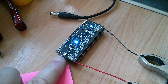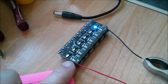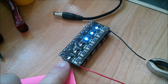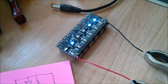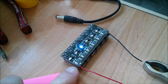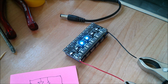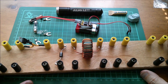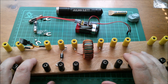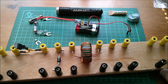I've added these blue LEDs — they're just in parallel with these resistors. Those resistors never see more than 2.7 volts. You can put 2.7 volts through a blue LED with no series resistor because it just isn't anywhere near the voltage required for a significant current to flow. And in any case, the current flowing through that LED is only flowing at the same time it's flowing through the resistor — so you want current to flow and discharge that capacitor at that time. This solar panel as input and the supercapacitor as output is likely to be one of the next things I do on the Muppet 2 on its new breadboard.